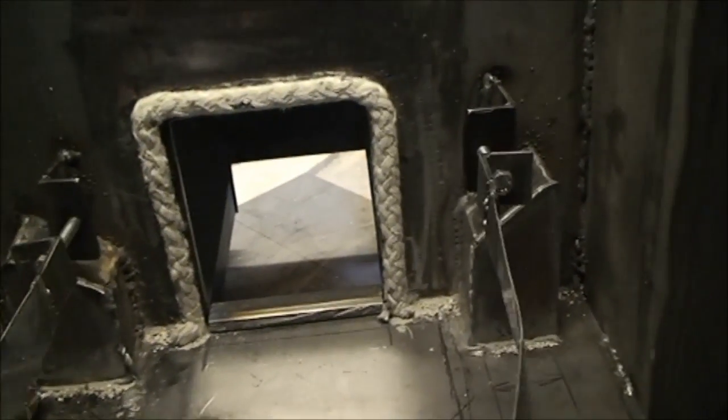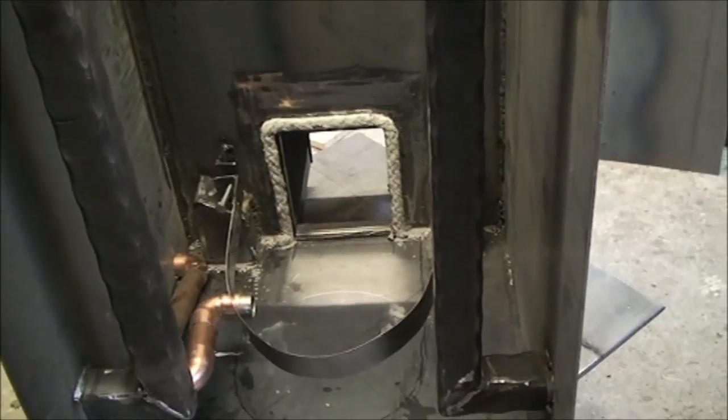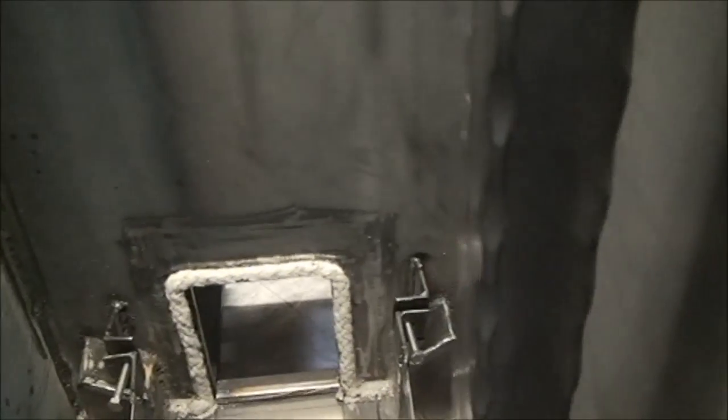I've made these two straps out of a piece of stainless steel, simply to hold the casting against the front. As I tighten them bolts up, it's just going to pull it against that gasket and keep everything in place — because once you get heat involved with things it starts moving things around, and I didn't want the riser tube climbing backwards and then having gaps where air can rush up.